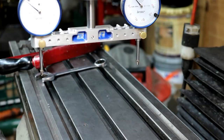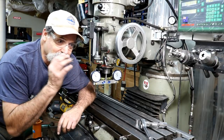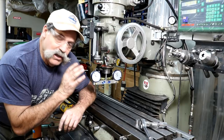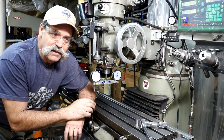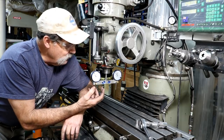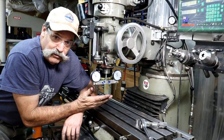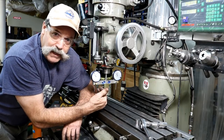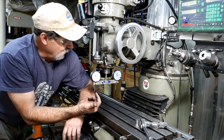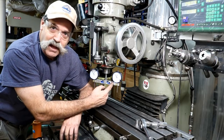It's not worth trying to chase tenths doing this. Thanks you guys, thanks for watching. Tramming the head is not that big a deal — this took about 35 minutes to do, not even 40 minutes. So don't be afraid to nod your head, rotate your head with the proper tools. Having a good tramming gauge is very helpful. There's other methods — you can swing an indicator around, which works just as good. Having a tool like this, there are several people that make these. James passed this to me — this is not a paid endorsement. This is a very good gauge. I've made my own gauges for this, but this one works just great. I like that adjustable feature — most are fixed one width, where his is not.